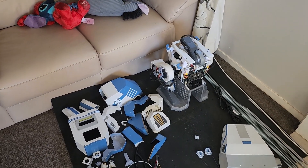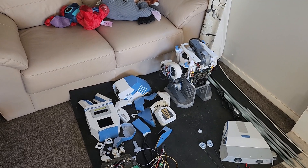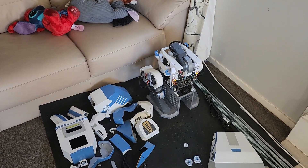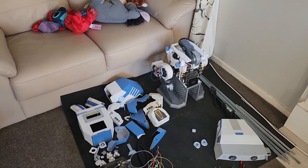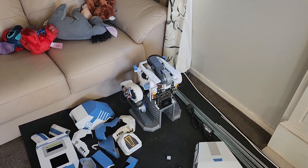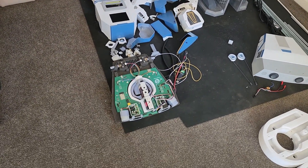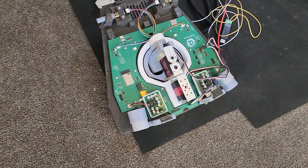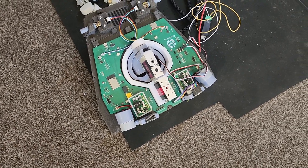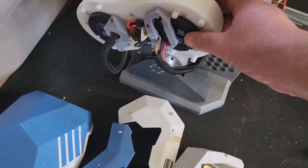Another work in progress — this one's going to be a long-running project with some steep learning curves around machine learning, effectively teaching this bipedal robot to walk. It's 3D printed, so the printing itself is relatively straightforward. The challenges are in the electronics: this is part of the head alone, with a 5V transformer, an ESP32, an SD card reader, a 12V controller for servos, and the main body runs these actuators off a CAN bus.